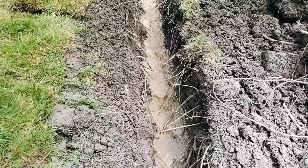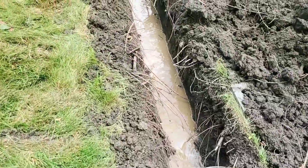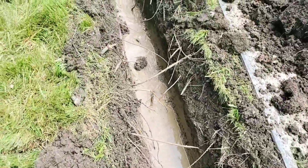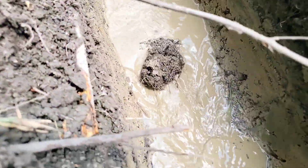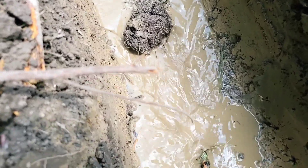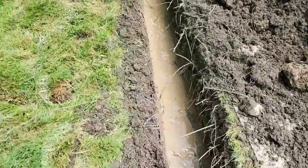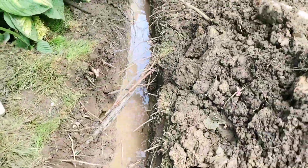Now, if it's not there, don't try for 4% slope. Don't even try for 3% slope. If it's not there and you've got a flat yard with no slope, you're going to be so deep by the time you get to the curb if you try for 3% or 4%. So if you're flat — just a flat yard, no slope — you're trying to create slope. In those cases, we're just working with 1% slope. Go for 1% because you're going to get too deep too quick.